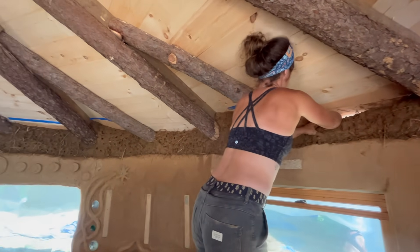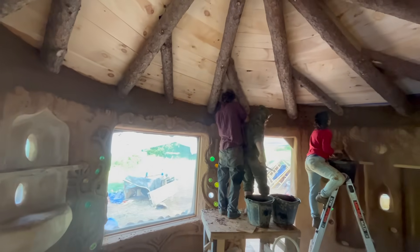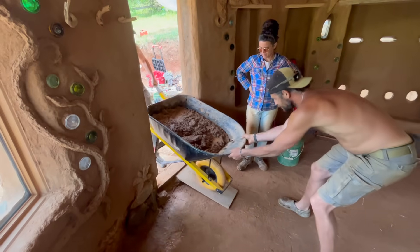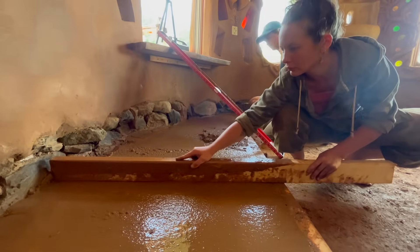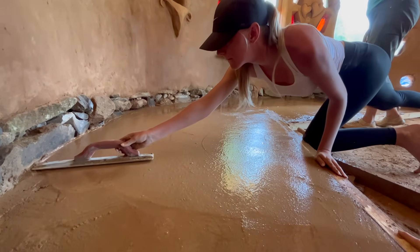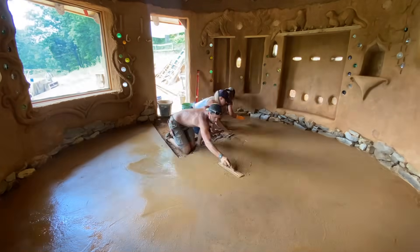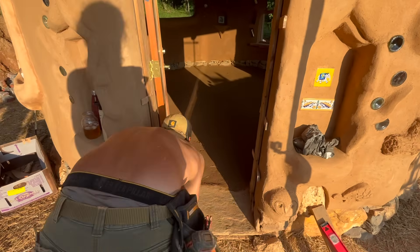We now only had a few things left to finish the build. We made a few more batches of cob to close the gap between the top of the cob wall and the roof, and then made and applied our last batches of clay plaster. To prepare for the final layer of the finished earthen floor, we dampen the floor and create our mixture using clay, sand, and manure. We pour the earthen floor mix onto the ground and use screed boards and trowels to level everything out, going section by section until the earthen floor is complete. For the final step of the build, we install the front door, and then the cob cottage is complete.